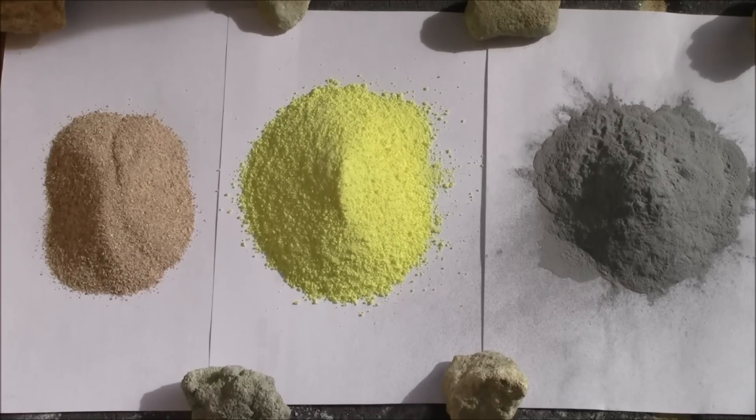In this video I will be making silicon from silicon dioxide, which I got from the beach, using the thermite reaction with aluminium. I will also be adding sulfur to help fuel the thermite, as aluminium and silicon dioxide does not produce enough heat to always sustain itself. A side reaction of aluminium and sulfur produces enough heat to keep the reaction burning.